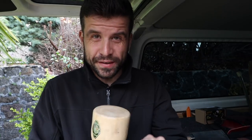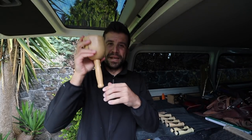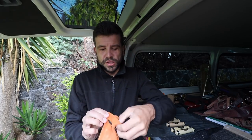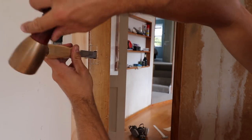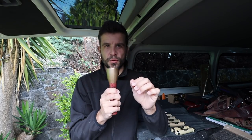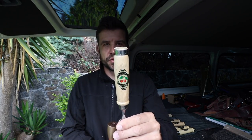To drive your chisels I use the Two Cherries Carver's Mallet. When you're carving you change angles all the time, so I like it because I don't have to look at the chisel when I'm hitting it — I can just focus on what I'm chiseling. But it's quite big to use, especially in and around door locks and tight areas. So for that I use this heavy little mallet. The mallet does all the work. The downside is that it tends to wear the timber on your chisel handle a little bit quicker.